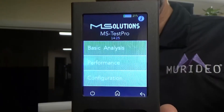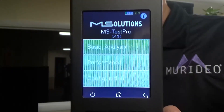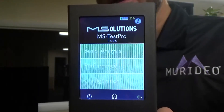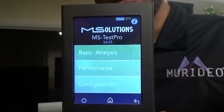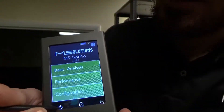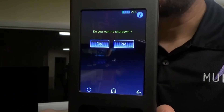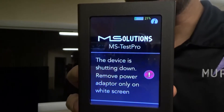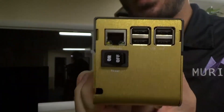Now that we know that the cable is passing a signal no problem, we should check it for DC resistance to make sure there's no issues with power interfering with the cable or the signal. Before we swap out modules, always power the unit off before swapping modules — tap the power button in the bottom corner and then tap yes. Once the screen turns white, you can go ahead and turn off the main power on the rocker switch.